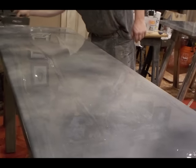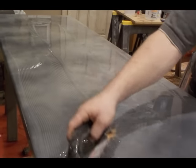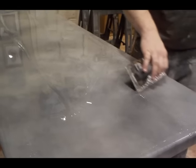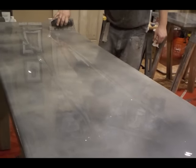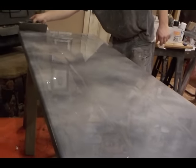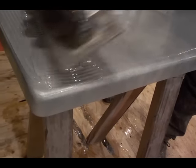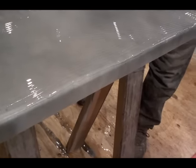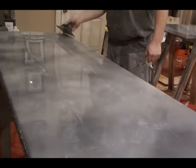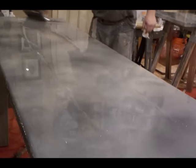It's actually really fast to trowel it out. This is an island that is exposed on all four sides so I have to make sure when I do my decoration it goes all the way down both edges. I'm running a bead of this clear material right up to the edge and it's starting to flow over the edge — which is just what I want. You don't want to trowel it so much that you start pulling material off your top. I'm not applying a lot of pressure; I'm just letting the trowel move the material.